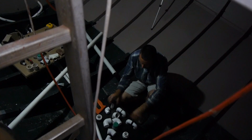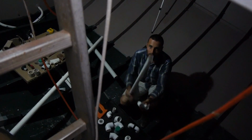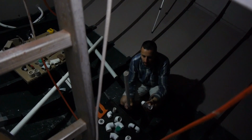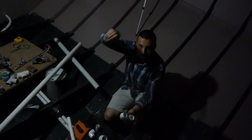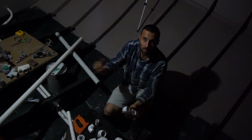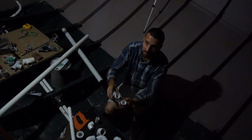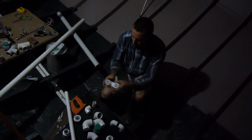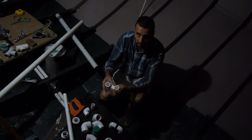So we're building the S-bends. Our piping is 25mm pressure pipe, or 1-inch PVC pressure pipe, and underneath where each drain comes down, I've got to do an S-bend, or else you'll get all the smell of a disgusting drain going into your shower all the time. So the S-bend is just to stop the smell. I'm not sure if you can buy 25mm S-bends, but it doesn't really matter, I'm building them.